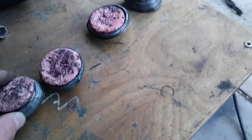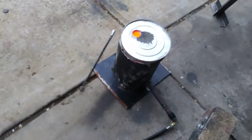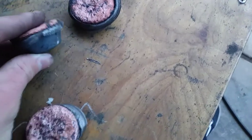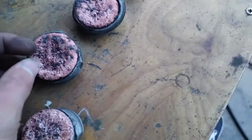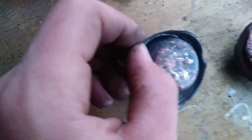It's already my first copper casting and I'm learning so much. Basically what happened is the casting went great — I cast all the ingots I wanted to, got all the copper out of the crucible, everything went well — except the copper fused to the muffin tin. I'm not sure if it was a coating issue, but the muffin tin was, I think, like 16 gauge, maybe 22 gauge stainless steel — probably regular mild steel.